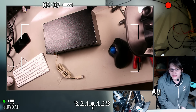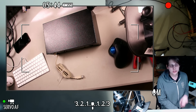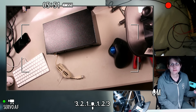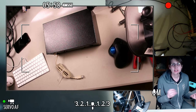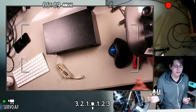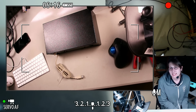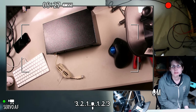And then interrupt is usually a little bit weird because it looks a little like bulk in that it's dealing with streams of packets, but it also has an aspect of isochronous, where there's reserved bandwidth set aside for polling the device periodically. So it's like bulk in that you can transmit bits of data back and forth and they get there when they get there, except that there's also a higher priority at play. Anything that's interrupt always gets a chance to transmit before bulk does. And then it has some other weird limitations as far as bandwidth, whereas bulk will just continue to try to transmit until it gets a NAK, during that one frame, up to a particular limit in the host controller.